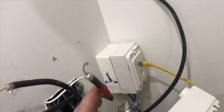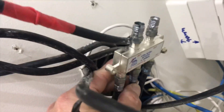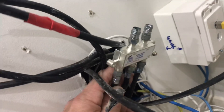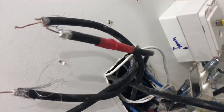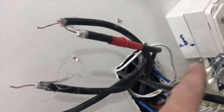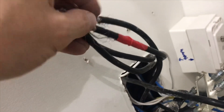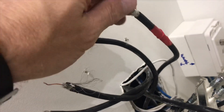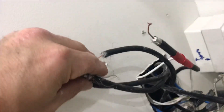Now I've found that cable — it was twisted along with all of these. It has the signal coming in from this one, which is bringing the signal in from the aerial on the roof. Then it has four outs, and one of them was going to this twisted pair and the other one was going into another cable over here. It also had another input for the Foxtel — luckily Foxtel wasn't connected, otherwise it would have been sending signal and nothing would have worked.